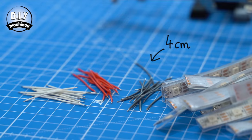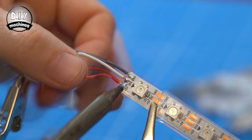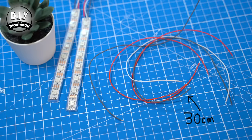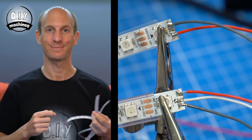To join the strips into one long length use a trio of four centimetre long wires between each of them. As you join your segments of LED strips into sets of seven make sure you pay particular attention to the directional arrows on the LEDs — this shows the direction that the data flows across our strip. The power connections at either end of our strips should also have some 30 centimetre wires attached to them. We only need to attach a single 30 centimetre long wire to the incoming data line. We'll be connecting the power at both ends of our characters to help reduce the effects of voltage drop, which will show itself as LEDs being slightly dimmer and leaning towards the warmer hues of colour.